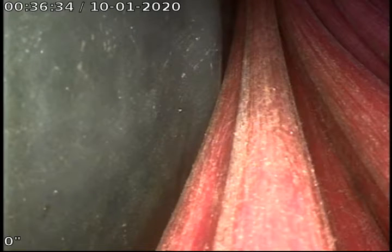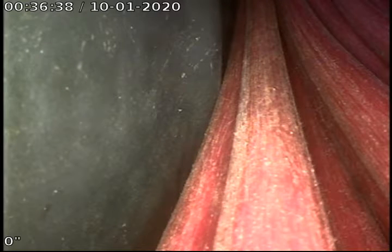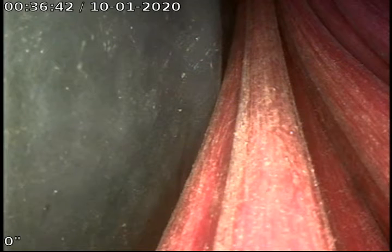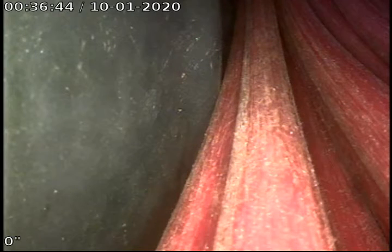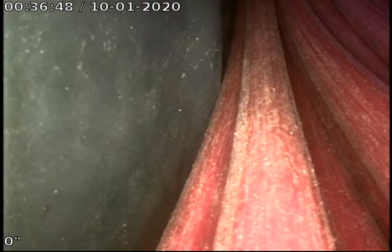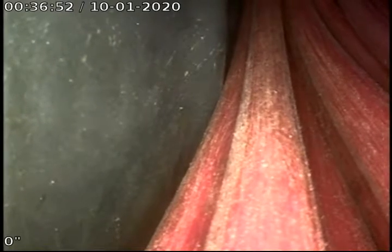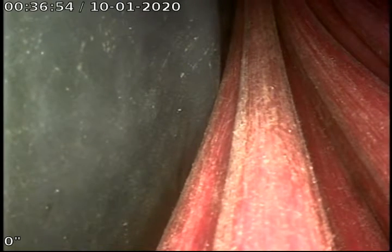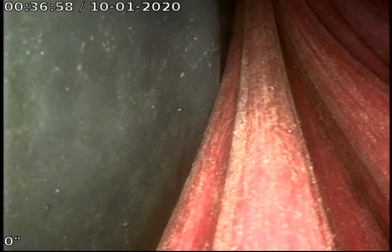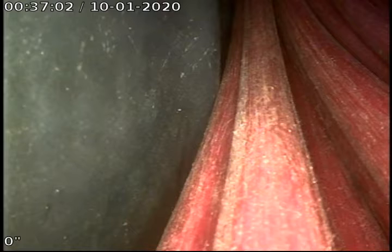We're performing a video sewer inspection from the back guest house, and we are at 618 North Naomi Street, Burbank, California, 91505. And there is a 3-inch ABS plastic mainline sewer cleanout. We're going to begin running through and attempt to get out as far as we can. Sometimes we can reach the city sewer, sometimes we can't.